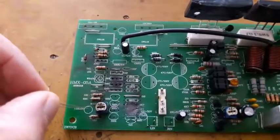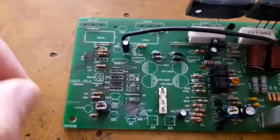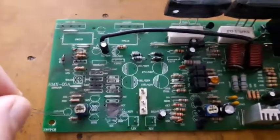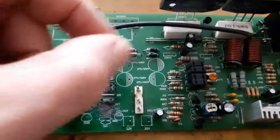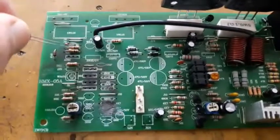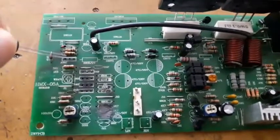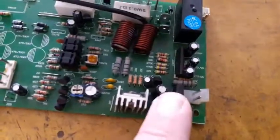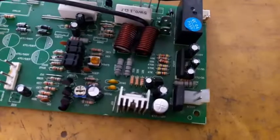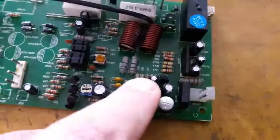This capacitor will be bridged in this way, and the other one will be bridged in parallel mode next to this capacitor. Those two diodes have been replaced. Those capacitors are not shorted, but this guy and all the other capacitors will be replaced. This regulator capacitor is dead, and also this regulator IC, which is a 12 volt regulator IC. I am going to replace them now.